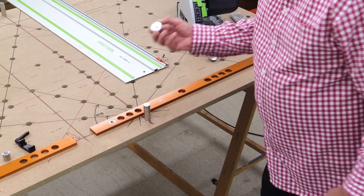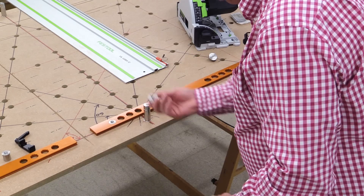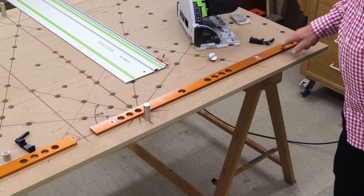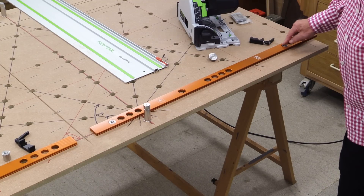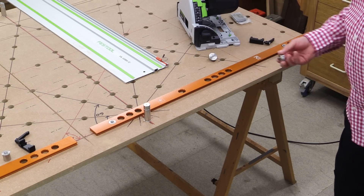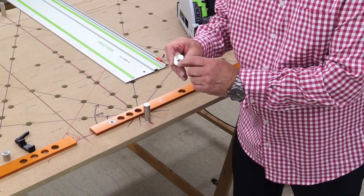I don't use these retainers at all, but there's no reason why you shouldn't — particularly if you pick up your tracks or cutting station and turn it on end from time to time. These would screw up from underneath. My advice is only tighten these up just a little bit; don't really wrench them tight. The reason is that when you come to the elongated holes, the actual bearing surface between the dog and the fence is relatively small, and by using a lot of pressure you can make a little mark on there, and it just isn't necessary. Just nip that up a tiny bit. They're available, and you can use these for other purposes because that's a standard 8mm thread, which you'll find in all of our other dogs.